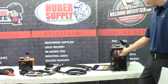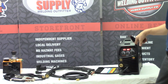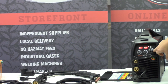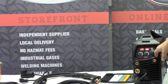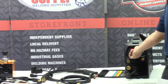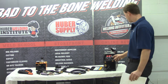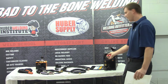I can also go into a feature called Smart Set. I tell the machine what size wire and what type of gas we're running, and it'll actually give us a good range of welding. For example, I just went up to 75/25 — that would be argon CO2 mix — with a .035 wire, and it's giving me a range now. Anywhere within this range it'll weld. If I like to weld a little hotter or colder, we can change that. It does let me fine-tune it within a couple of notches.